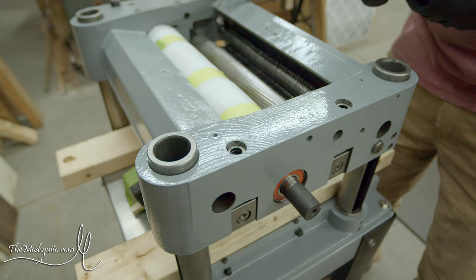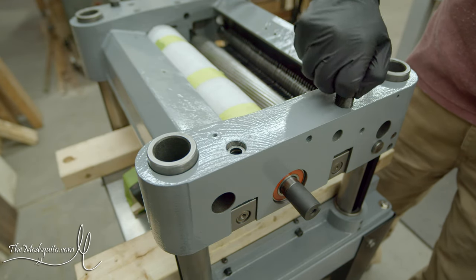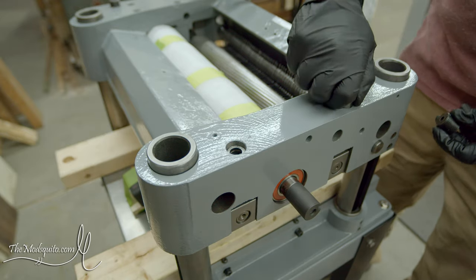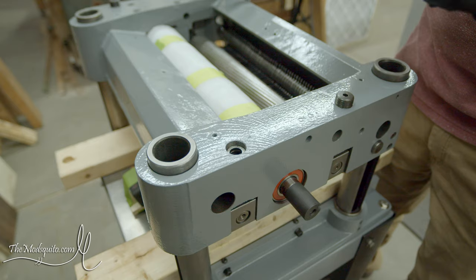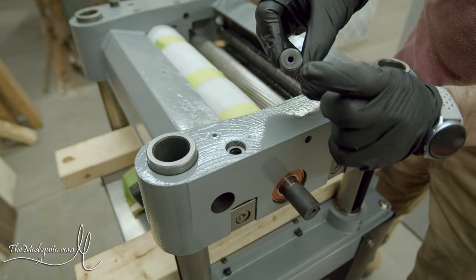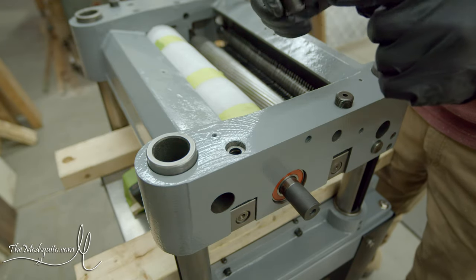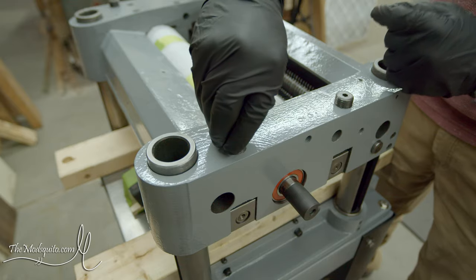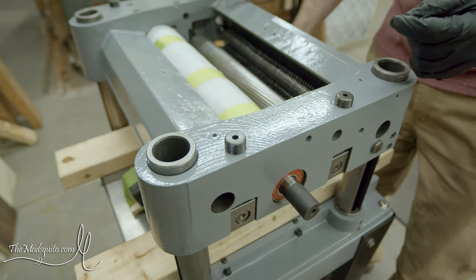All right. Also, don't forget that these little plugs go on the top for holding those springs in and then also holding the spring tension. And there's a definite top and bottom. So there is a hex on the top, just a hole on the bottom. Hole goes down. There is a hole through the hex that goes in, so you're going to keep adding oil without having to unset your spring tension every time.